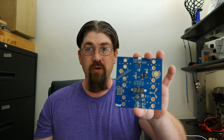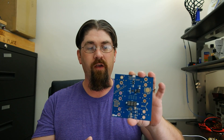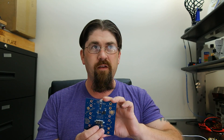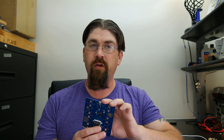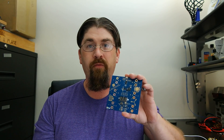After a few months of working on it, I've renamed it: it's now the Infinity Solar Bank version 4, and it's a major upgrade. Instead of holding two super capacitors like version 3, this now holds up to six — you can run it on one or up to six. I've put a voltage display on here, and we're now using the Texas Instruments TPS61021A boost converter, which can put out up to 1.5 amps when the super capacitors are fully charged.